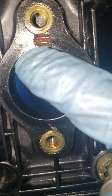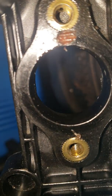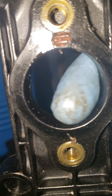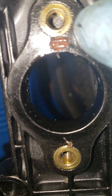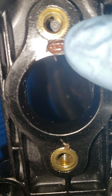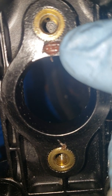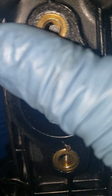You have to be very careful when drilling here — you don't want to go in crooked and end up eating into the saddle or this opening, and you don't want to drill into the seat for the bolt. Make sure you keep your drill bit very straight and centered, then slowly step up the size of the drill bit one size at a time until you get all the way through and can drop that allen key through.